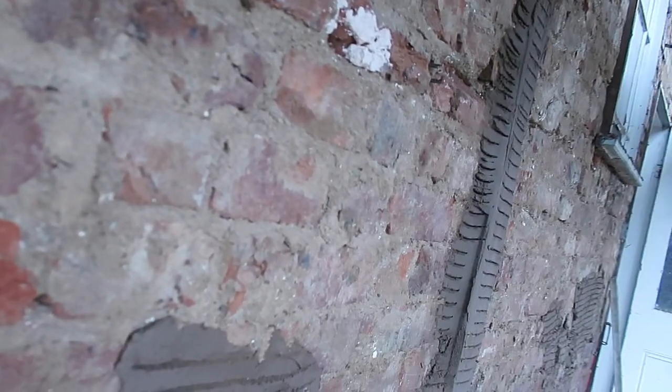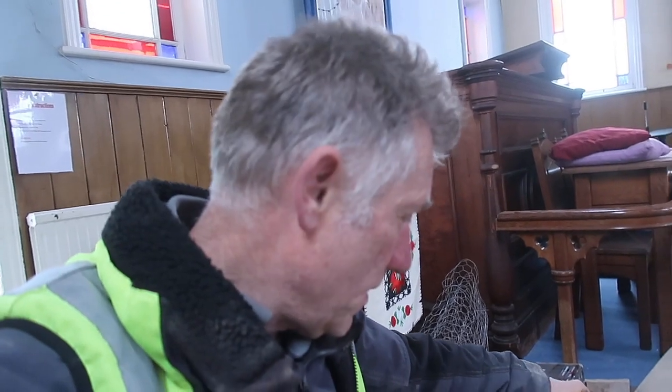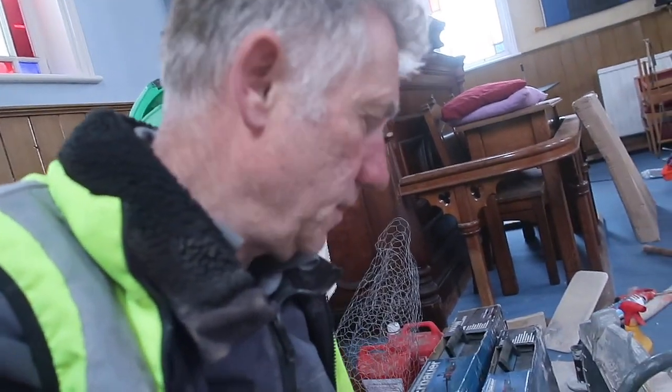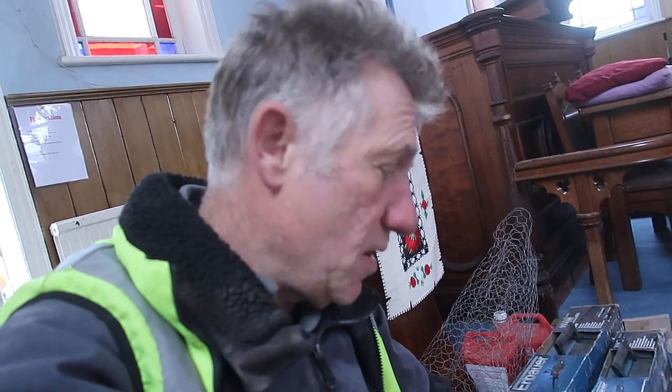I can see I need to build it out down here a bit more — that's where I'm at at the moment. I've done the same there. I'm going to put some more prep on this wall. Don't just do it on bare brickwork. I'm going to put this stuff — exterior SBR bond — that will go waterproof. And also this render grip, to give it a good grip for the render to grip to. So I'm going to crack on with that. It's quite a big project.